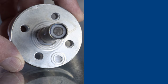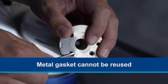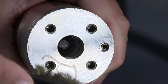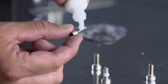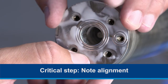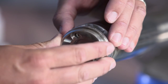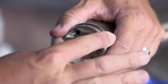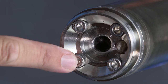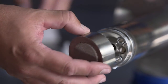Set the old cell aside. Remove the metal gasket from the probe body and discard it. At this point, you must clean the machine surface of the O2 probe with an emery cloth or brush to ensure your surface is smooth and clean. Now you will need your kit. Apply anti-seize to the four fasteners and the metal gasket. To start installing the replacement cell, place the new gasket on the probe end and place the new O2 cell into the probe body. Alignment is critical here — ensure that all five holes are aligned correctly and pay attention to the orientation of the gasket. Using a cross pattern, torque the four fasteners down to 35 inch pounds. Now reassemble your flame arrestor if your product contains one, then install the diffuser, applying anti-seize to the threads before screwing it on.